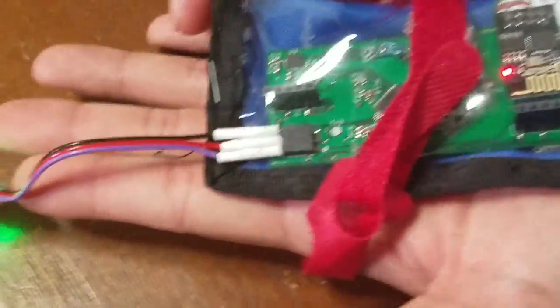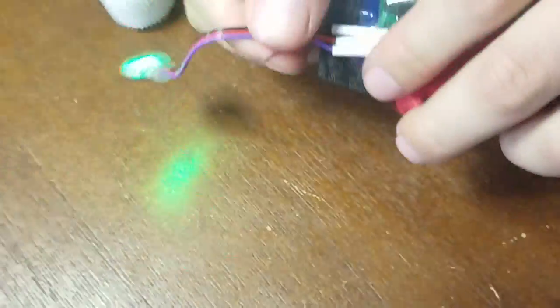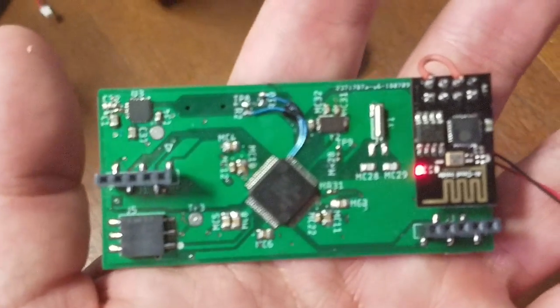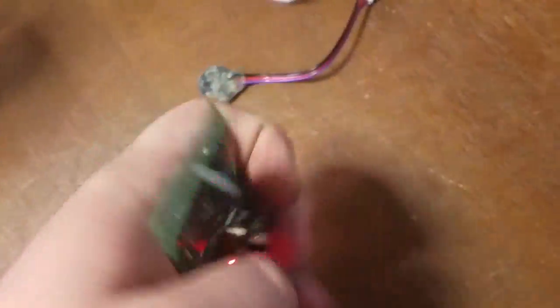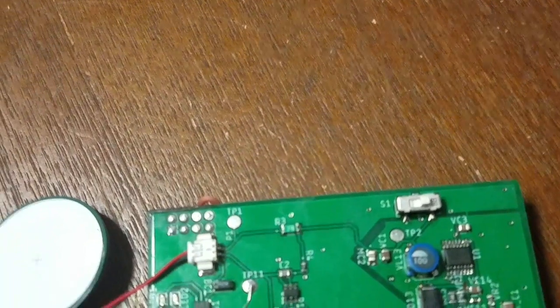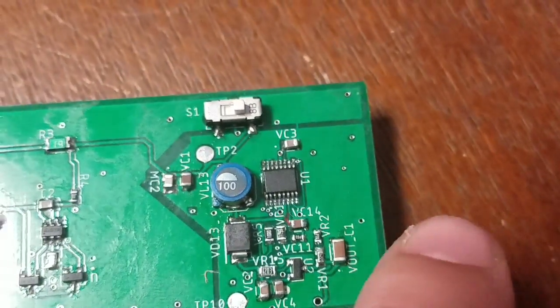The last piece we have is our wearable PCB. Here you can see it in its packaging — we're going to take that off and open it up. This is our four-layer board design. In the middle we have the MCU, and on the right-hand side we have the Wi-Fi module. Where my thumb is, that is the accelerometer, and here is the connector for the pulse sensor. On the bottom side we have our micro USB header for battery charging, this is where our battery connects, this is our fuse, and here is our power management IC and voltage regulator running the system.